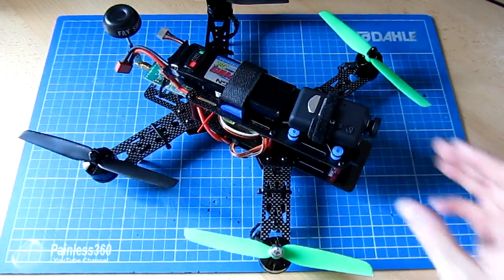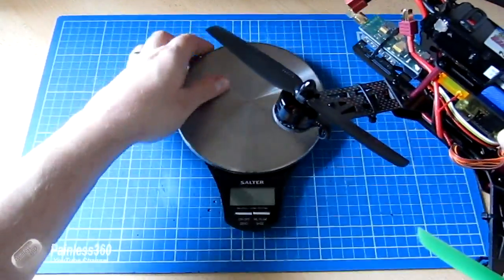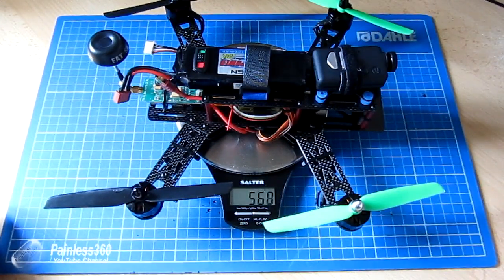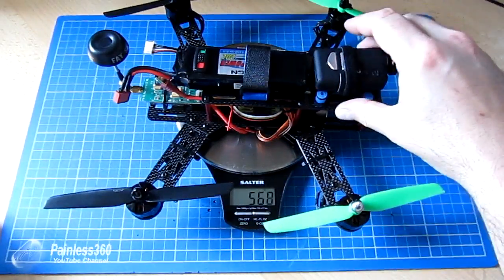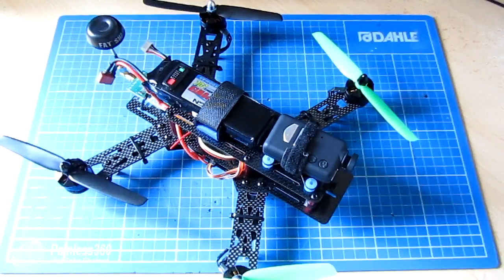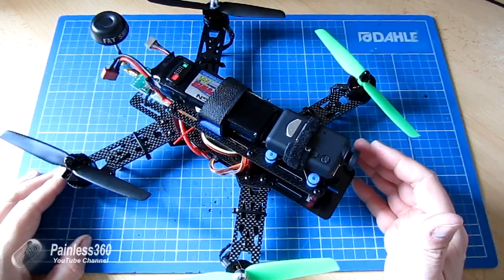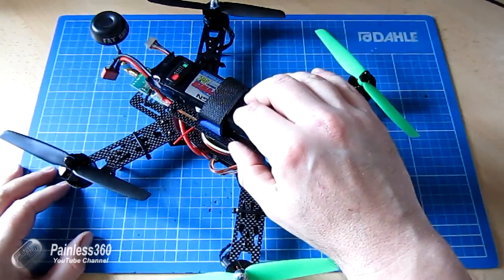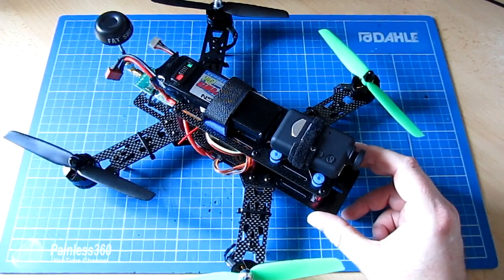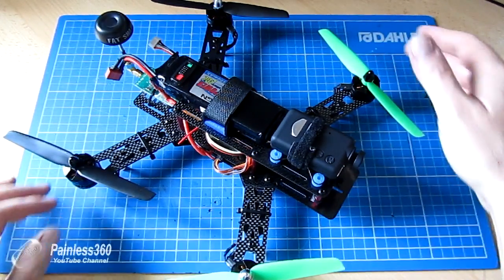When it's together it is fantastically rigid and because of its light weight it takes crashes very well. Even with all the FPV gubbins on it still only weighs 568 grams, and it's under 500 without the FPV equipment, so it's a very light little model. Coming from 450 and 330 class quads it has very little inertia and is very nippy. I'm getting anywhere between eight and a half to ten minutes flight time on a 2200 milliamp hour pack, hovering just over half throttle with lots of power in reserve.